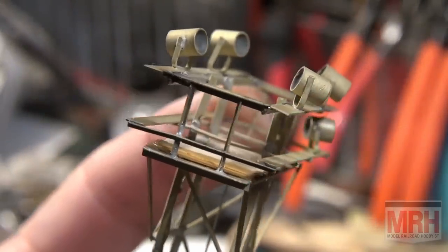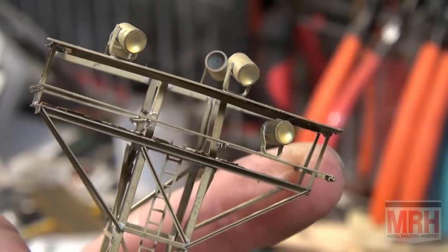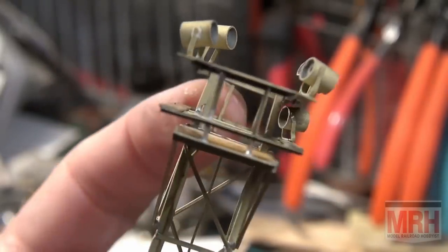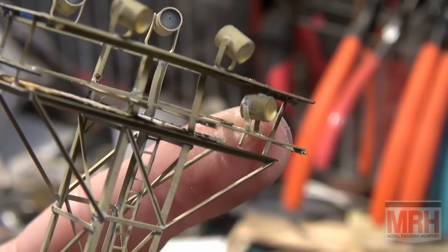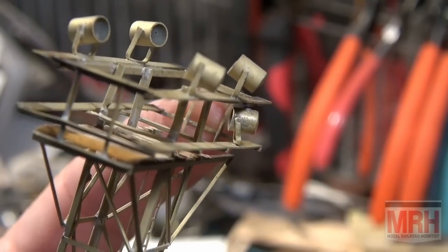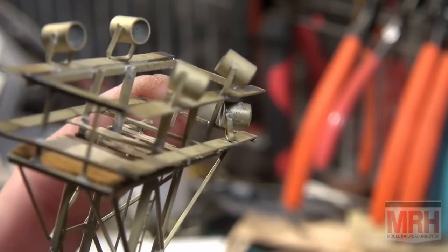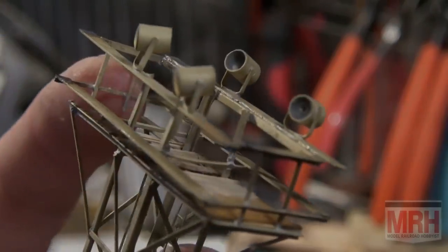And just like that, the light tower has been sort of refabricated, and it's fixed, it's repaired. And you couldn't have done that with another tool. I didn't use a pencil tip on it because really, in reality, the resistant soldering rig is the best tool for doing this. It really heats up that small area quickly, whereas a pencil tip would have probably gotten some of the other parts heated up, and then we'd be coming apart again.